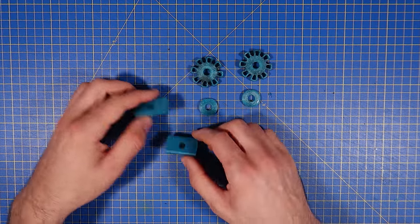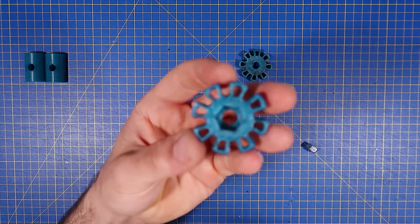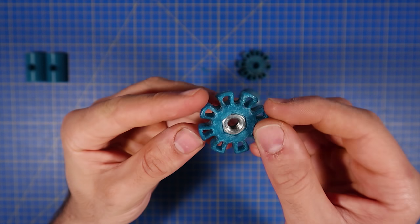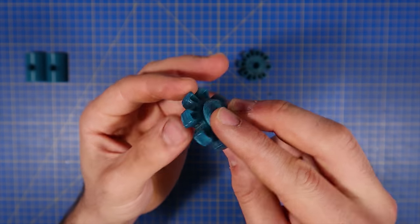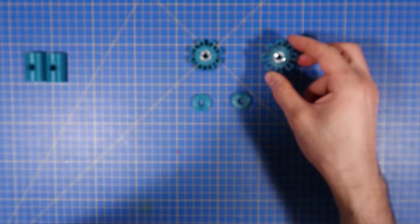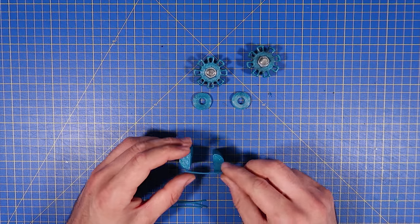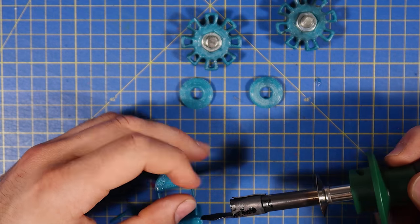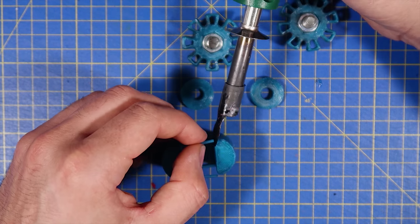Now I repeat this same operation to the other parts, but first I insert two nuts inside here so that they will be embedded in the aluminum. And I do so because cast aluminum is soft and I'm afraid that tapped threads would wear out easily, since I'll be tightening these two nuts over and over every time I want to change the angle of the jig.